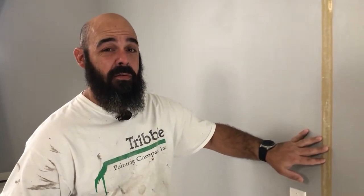Just a real quick note: when you have adhesive on the wall like this, you really want to do your best to try to get it off for a couple reasons. One, if you paint over it, it's going to leave a rough, nasty finish that's not going to look good. And two, you're probably going to have some adhesion issues that could cause the paint to fail and start to chip and flake off long before it normally would.